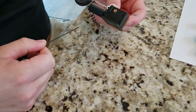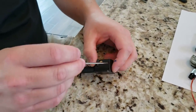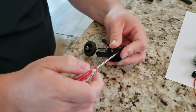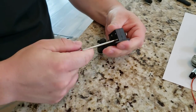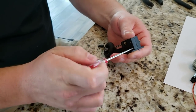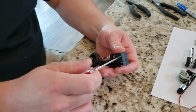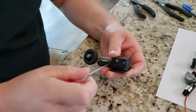oh, dang it. I'll have to find a different size Allen wrench for that. But basically, I'm gonna tear this apart just like we did that. And then we can interchange that one shaft. Obviously, I'm gonna have to cut this at the appropriate length and then probably mill out a flat spot on it so that I can catch my set screws. You don't have to do that, but it's better if you do. You'll get a more positive seat, and you'll have a lot better pressure so that you're not veering off to the left as you're running down the highway, trying to get up to speed, or the runway rather.